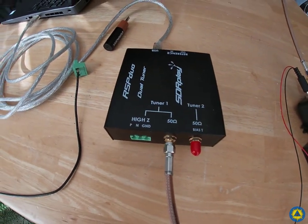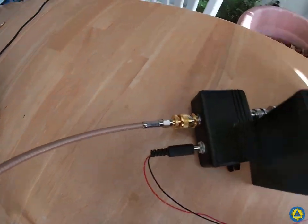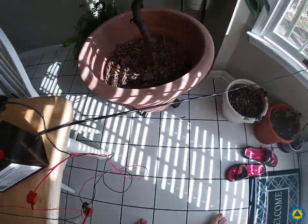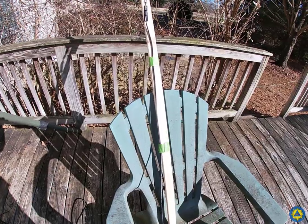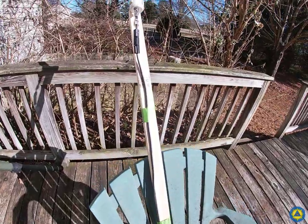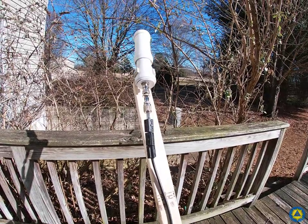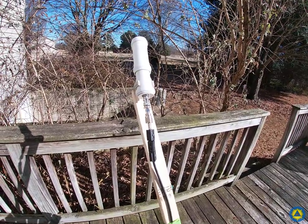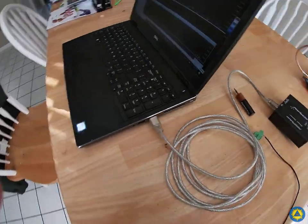It gives us new options to either hook up a bare wire or use something like the mini whip you see here, with its power injector box powered by a battery to an external antenna — which is really nothing more than an electric field sensor with a preamp in it. The cable comes up to the top of a wooden stick with three type-75 ferrites in line to keep it well isolated, appropriately chosen for this. It's just a little paddle antenna feeding a preamp and a driver for the 50 ohm cable, and that in turn goes all the way to the Duo's input.